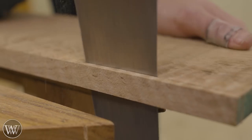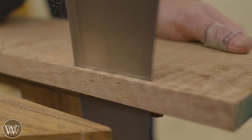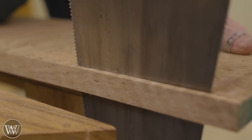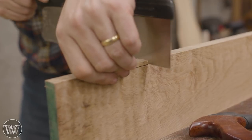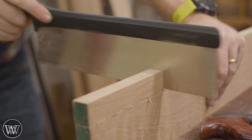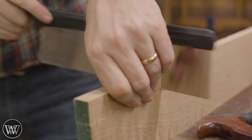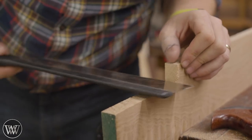I'm going to rip it down with a tenon saw, get it really close, and then I have a thin panel saw that I can finish it up and get it right down to that line. You'll see that this particular one I was shooting the video on is a really curly white oak, and that causes a lot of issues. I wanted to show the worst one I had in the video, so you get to see the most fun I could possibly have - a lot of curly oak, beautiful though when it's done.